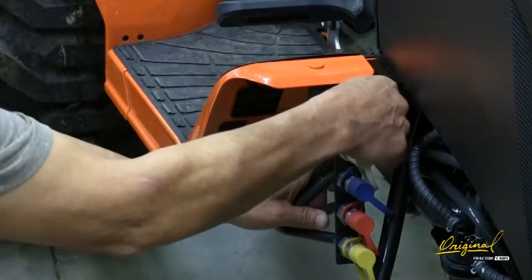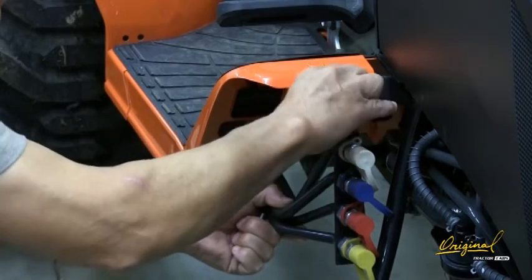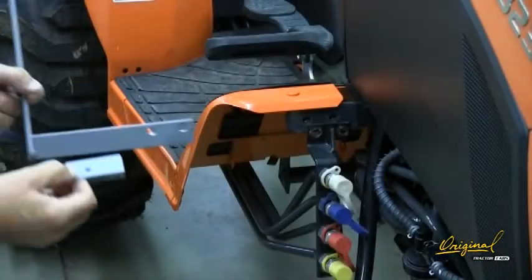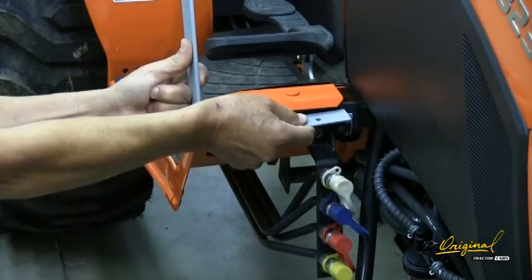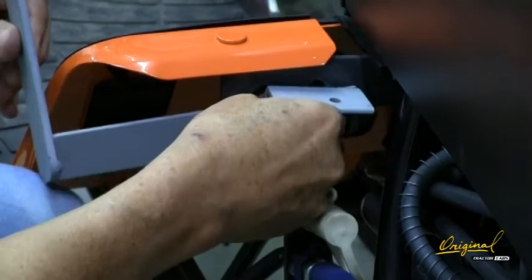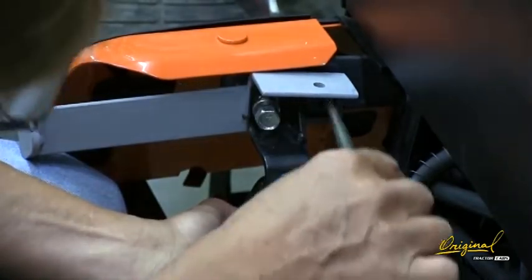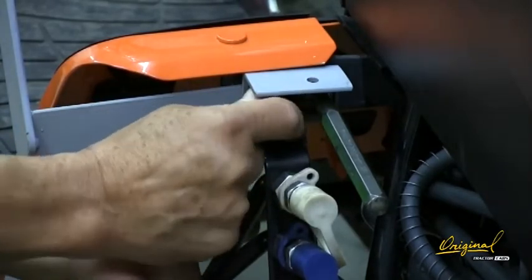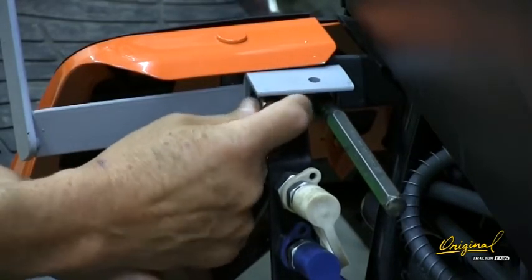Step 3. See Figure 3. Install the right and left foot 1 and 2 in the right and left front panel bracket 4 and 5. Remove the bolts at holes B. Place the foot and the front panel bracket in between the hydraulic bracket and the floor support. Insert M10 x 30mm bolts with lock washer. Do not tighten at this time. To install the left foot and front panel bracket, attach the parts to the floor support with the two 3/8 x 1 inch bolts and lock nuts. Do not tighten. Use an alignment tool to help align the holes while inserting the first bolt.